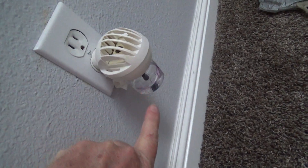Let's say the box is on the outside of the sheetrock wall — then this rectangular bit fits inside that box and you don't want these tabs because if you have these little tabs, that's going to be on the outside of the box and let it stick out further. Your cover plate might not fit tight to your wall. So then you would pop those off. If I broke those off, I would save those — I use them for little shim washers for later on.